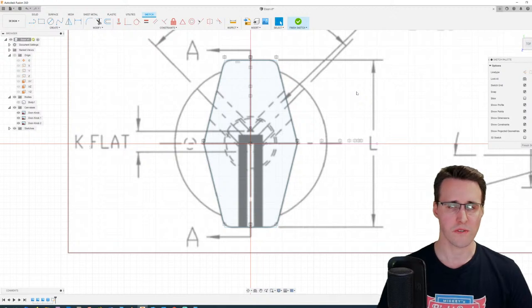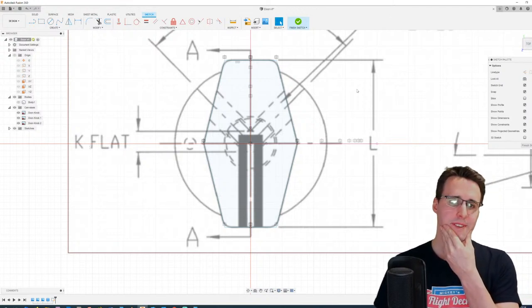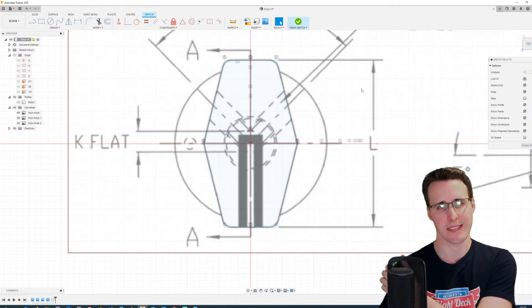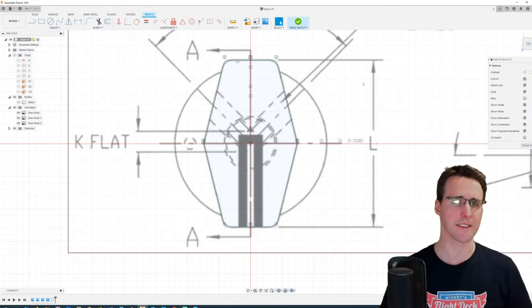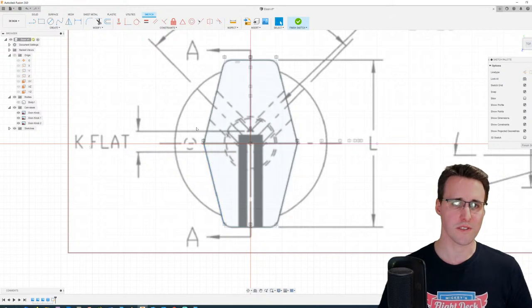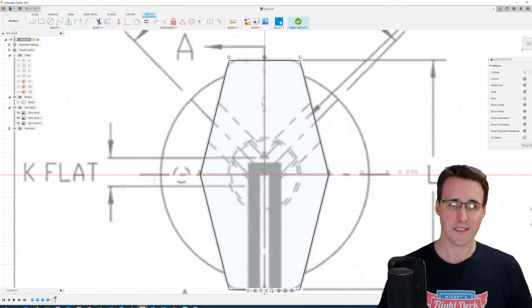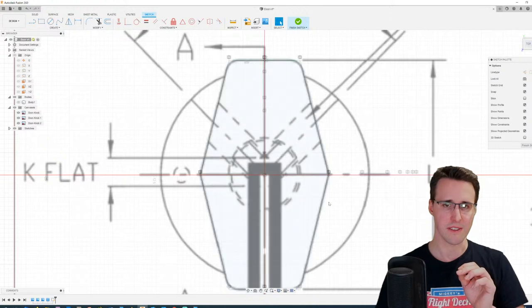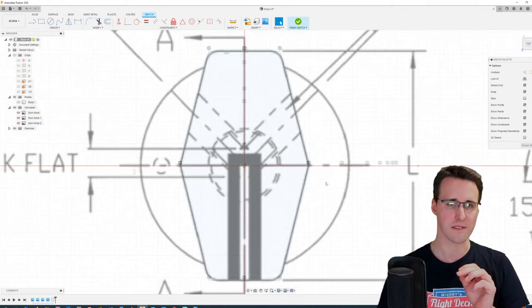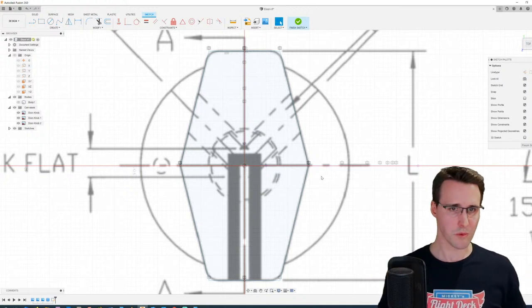And now we can already make an extrusion. Yeah, I think we can also wait with the mirroring and make the mirroring later. Just my thinking. Later we will have to add roundings in these corners. And when I concentrate just on this top left quarter, then I can make this drawing and the extrusion just of this quarter, make this rounding here, and then do all the mirroring that I have done right now. And then all the edges are mirrored.